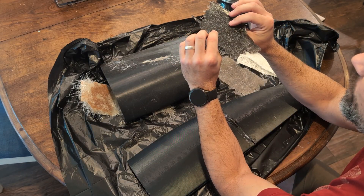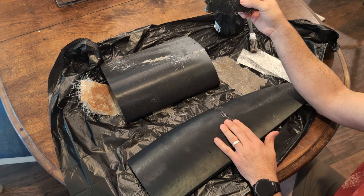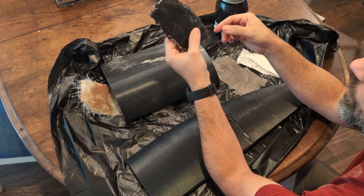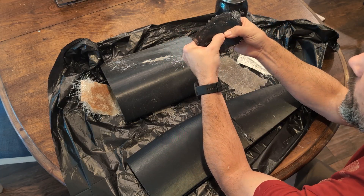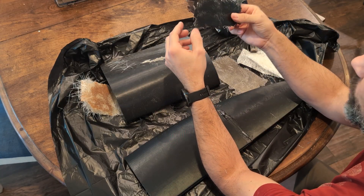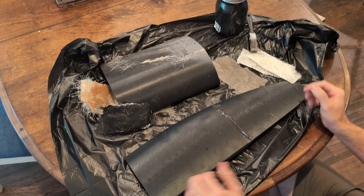So I came up with the idea: I have fiberglass and I have the slurry — why not impregnate fiberglass with the slurry? This actually gives a really good bond to the ABS because you're basically welding the fiberglass to it. I did a test piece on wax paper first. The two properties I was looking for: I don't want it to shear — this has a lot of shear strength — and I don't want it to stretch, which it doesn't. So we're going to try it on this piece and test the strength.